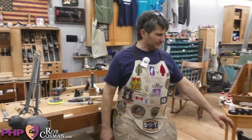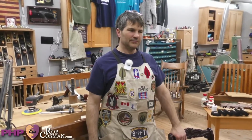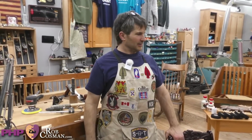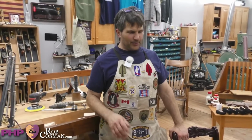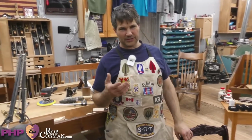Frick, what is your opinion of this? It's from James Carey in Hilliard, Ohio. Hi, James. He says, what is your opinion of the use of dowel joints in chair construction? You missed the earlier part. They suck. Dowels are the easy, the quick and the dirty. The best joint for chairs is a mortise and tenon, and locked if possible.